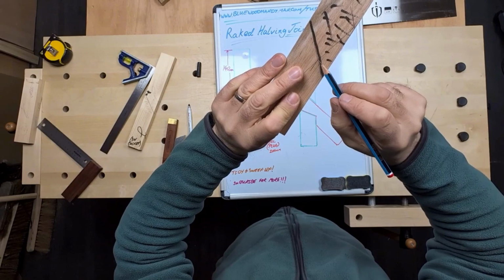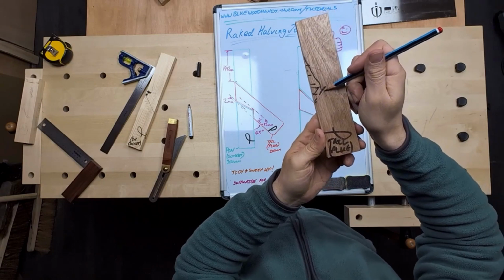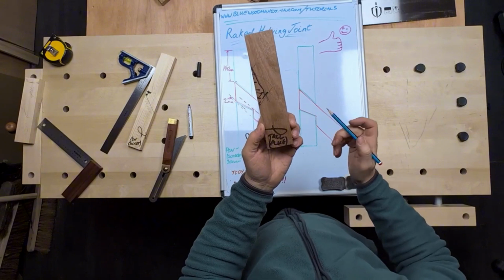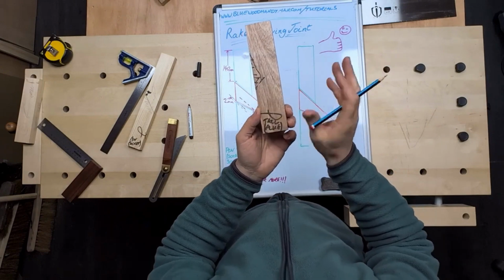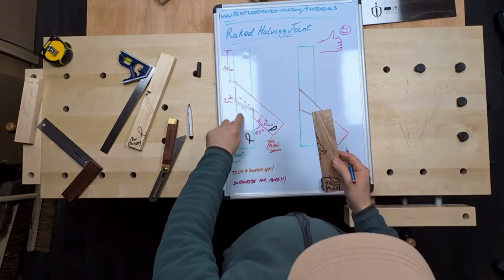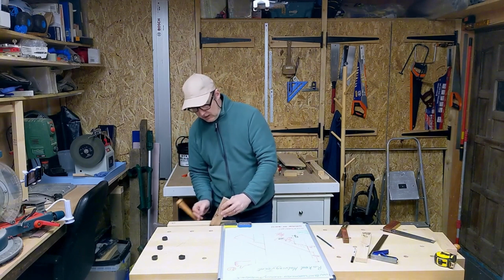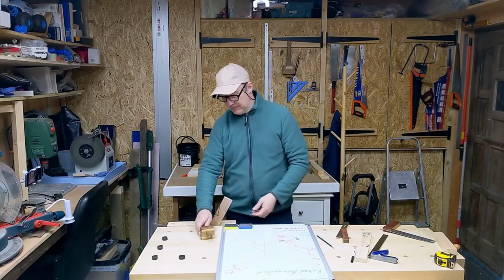What's important is this 15mm point. They're both important, but the more important one is the 15mm point, because if there were multiples of these, this is what you would see. It's like the base of the dovetail. This is the bit you're going to see. If that runs out somewhere off the timber, it may get planed off and cleaned up later, and you may not see it. So now that we have just this angle marked out, we are still not ready to cut. We need this in our vise, and we need to take care with our marking gauge where we're going to mark it up.